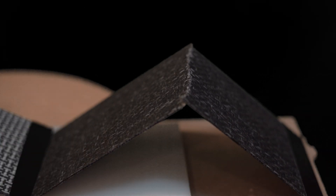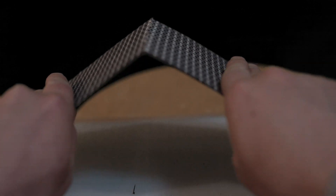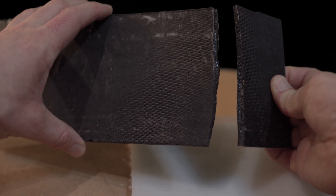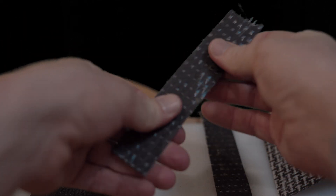Innegra makes carbon less stiff — you do lose some strength — but this is useful for impact and flex endurance. It's a bit lighter, but only the Innegra component offers that benefit, and it seems to drink more resin. When it fails, it depends on how much Innegra is in there. I didn't find the co-mingled weave too useful as the break won't hold a structure together. The 50/50 hybrid, however, gives you a post-disaster second chance. Carbon fiber non-woven mat: it's a nightmare to work with, needs enormous compression to consolidate, drinks gallons of resin, doesn't give you the stiffness of woven carbon, and when it snaps, that's it. I'd use fiberglass instead.